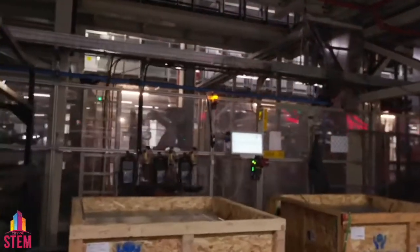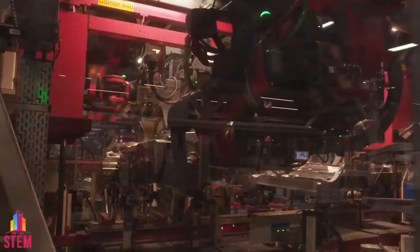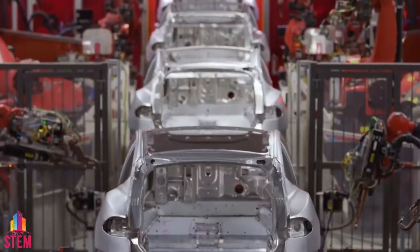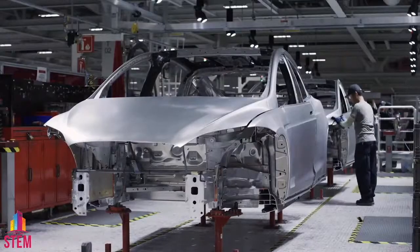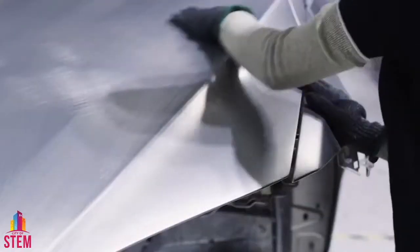How beautiful — we're doing some spot welding. When we do spot welding with high strength steel, you get those gorgeous sparks. Totally normal. Once the body panels and casted components have been welded, riveted, and bonded to create this unibody framework, we call it a body in white, which is an artist reference meaning blank canvas, ready for painting.